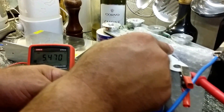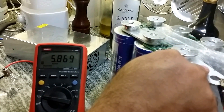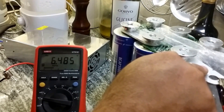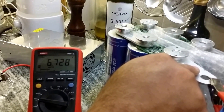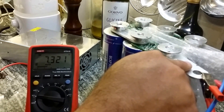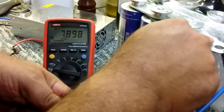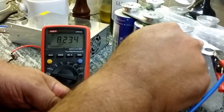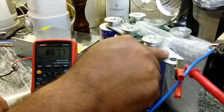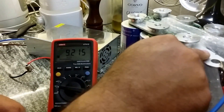Here goes — look at the meter. Can you see it's very fast? Now there is not a dead short, so the transformer is handling the charging capacity very well. I'm always checking this wire — it's rated up to 100 amperes — but the connector I'm holding with my finger is getting a bit warm. Remember, it's 66 amperes being pumped into these ultra capacitors.